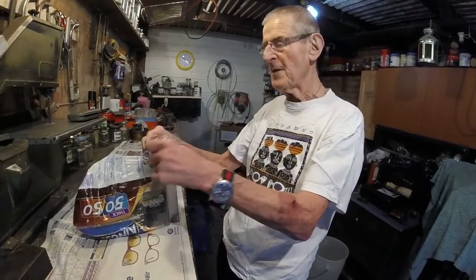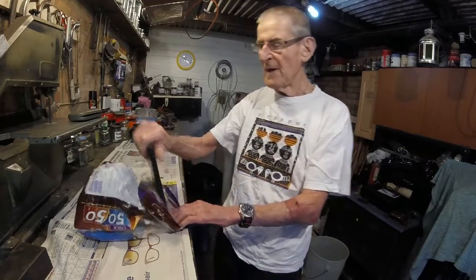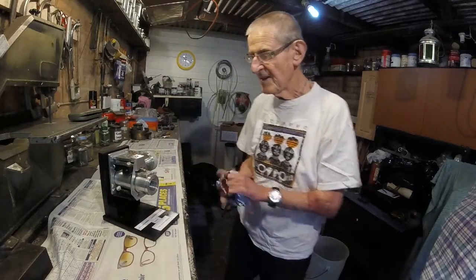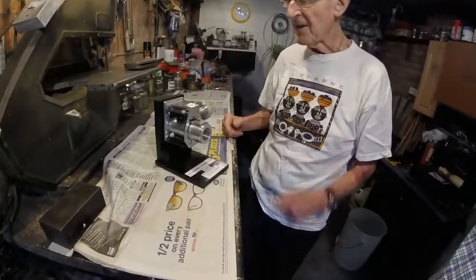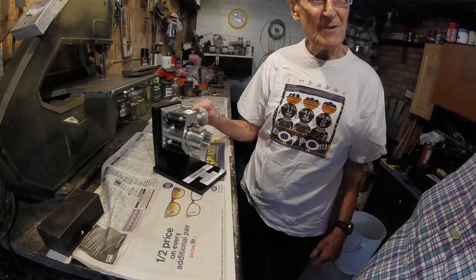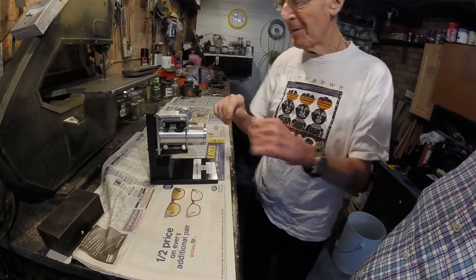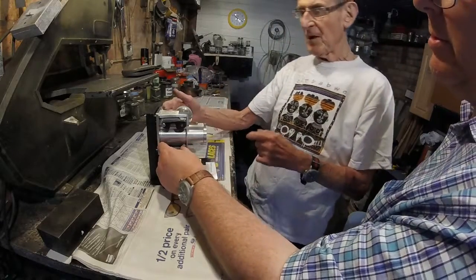John was working on a 90mm apo refractor and has taken it upstairs this morning for testing. He shows an older focuser design from about three years ago — it's completely different, it's a rack and pinion. But it's actually a hybrid: the tube is supported in the usual Crayford way, with two rollers running on a plate independent of the rack. So it's a sandwich — Crayford at the bottom, traditional, and then some spring-loaded rollers with two rollers on either side of the rack.